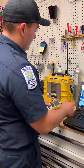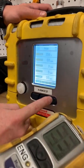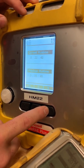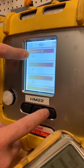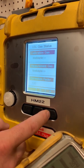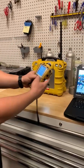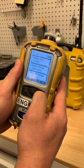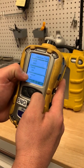When we come in, we're going to check our monitors and cycle through the menus. Once we cycle through the menus, we're going to make sure we get to the ISM menu. We want to check the network ID to make sure it's 69, and we also want to make sure our channel is set to 10. On the smaller unit it's the same — go through wireless and make sure the channel is up to 10.